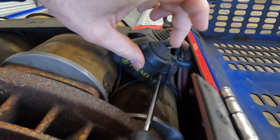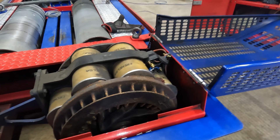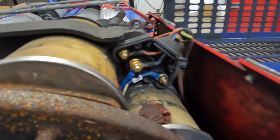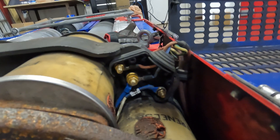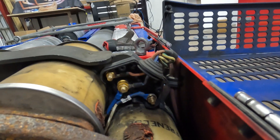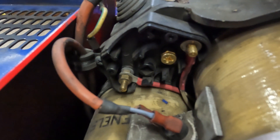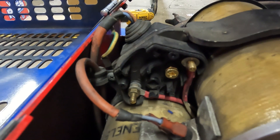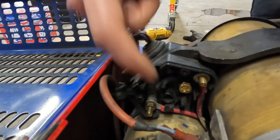I just finished wiring up the brake going from 96 to 192 volts. Now you might have seen when I took this cover off, I only had these two outer connectors and the two blue wires coming from the brake. They went from just this — we'll call this one and four. Now on the opposite side, these wires here also come into what we'll call one and four. There's a nut missing there, but I just haven't put it completely back together. So I had to add a stud on mine. Now some of them will be fully populated one, two, three, and four.